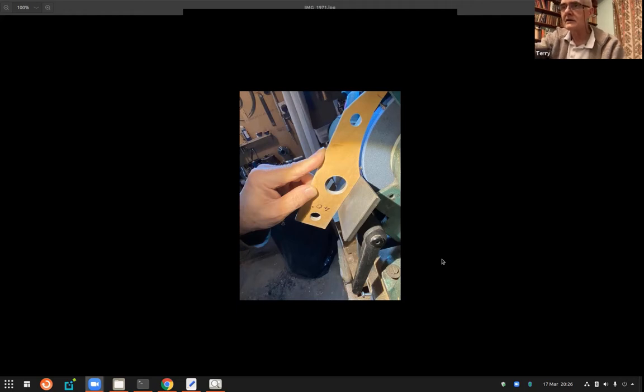So you can either cut the curve a little bit hollow, so it's touching at the top and bottom only, or as I usually do, I put in some little wood screws. There's one at the top and one just above the platform, if you can see them. And then you've got metal contact on the wheel, which of course is switched off. Also, because they're screws, you can adjust the fit slightly if you want to change the angle very slightly, but I don't find I ever have to do that. So that's ever so easy to make up. And what it does is gives you the same platform angle every time. It references to the wheel. It saves a lot of mucking about.